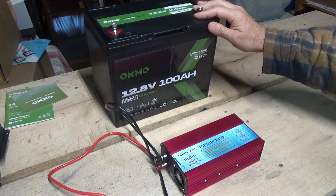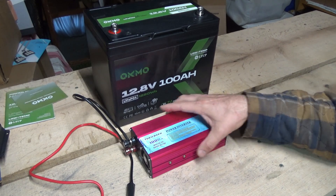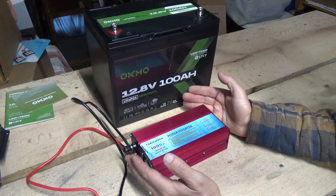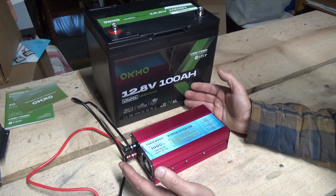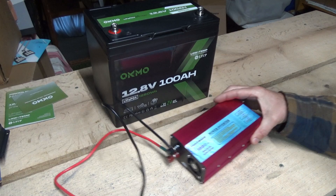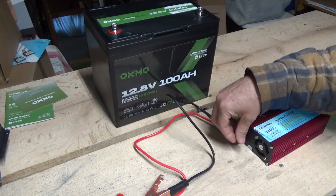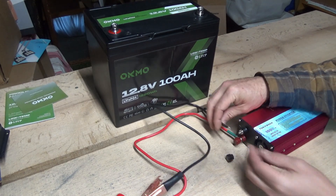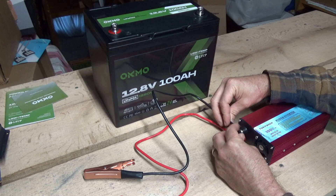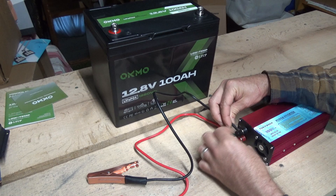This is going to be very basic and simple so anybody can do it at home. First, the easiest thing you could ever do is hook up a power inverter and power a load — like let's say your laptop. You need to get on your laptop, check emergency services on the internet and get a load powered. So any power inverter generally has two screw-on wires like these. I already have them connected but I'll take them off just for demonstration purposes. You just simply put the black one on the black terminal and the red wire on the red colored terminal.